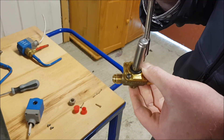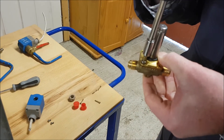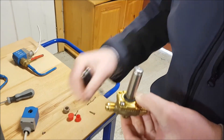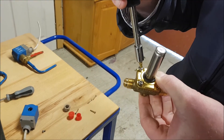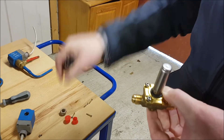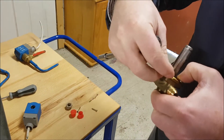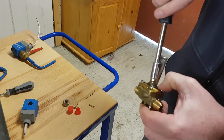It's like torquing. When you're sealing anything with a gasket seal, you would never do one side first and then the other side, because you run the risk of pinching the gasket or pinching the rubber seal. When I go to tighten this, I'm going to be counter-tightening each screw at opposite corners.